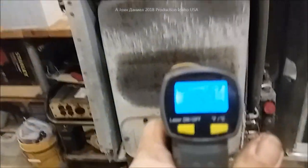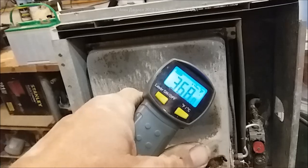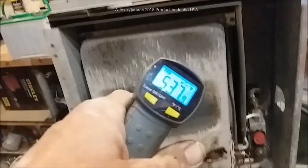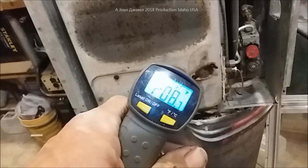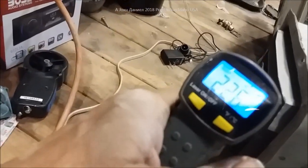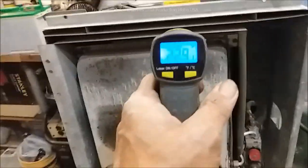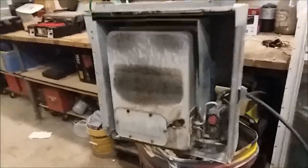I would say I've got plenty of heat. The shop floor temperature is 59 degrees in here and the heater is at 360 degrees. Down closer to the burner it's 500 degrees. This is the baffled chamber up here — this is the burner expansion chamber and then this is the air inlet chamber. All that explained: you've got 81 degrees at intake air with an exhaust of 227 degrees. That gives you an idea of how much efficiency you're dealing with — that's your air temperature exposed to your room, and there's a 300-degree difference coming out versus exhausting. Pretty efficient. Alright guys, that was easy enough. Hope the video wasn't too long, but there you go — repair it yourself.